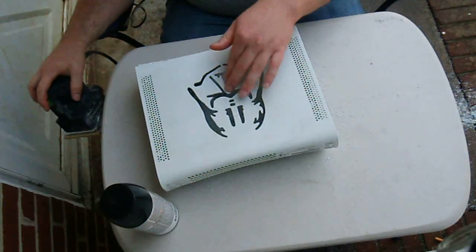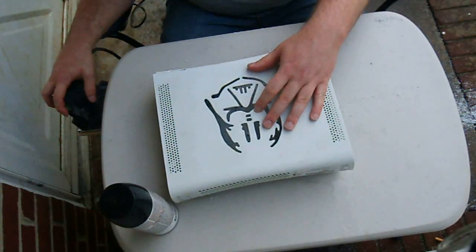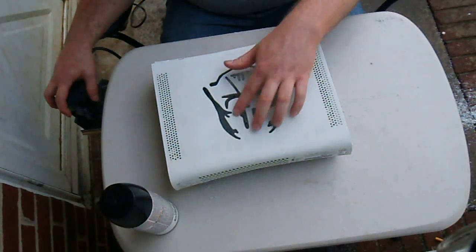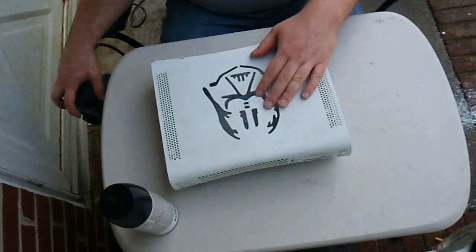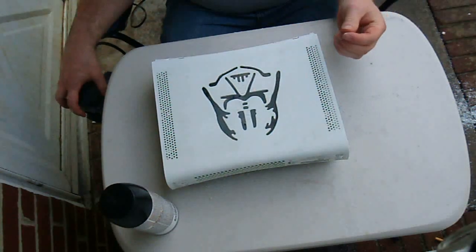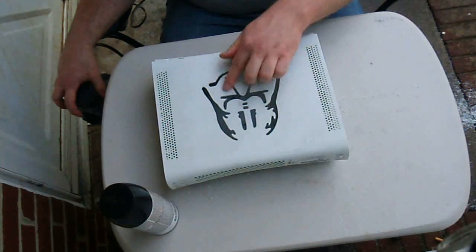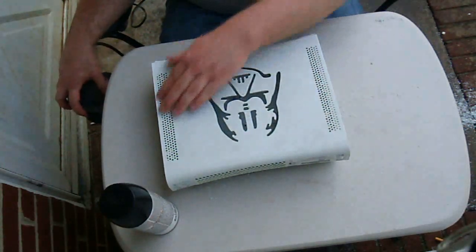Another thing I will say is these areas here are going to bend while you're putting pressure on them, so they're not going to be as easily sandable. A good thing to do, if you're not quite sure you sanded it enough, is get a little pencil and put markings all around in these areas, or whatever your design is, and all around here.